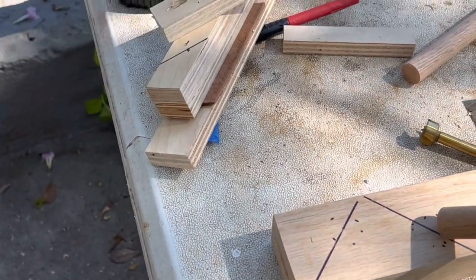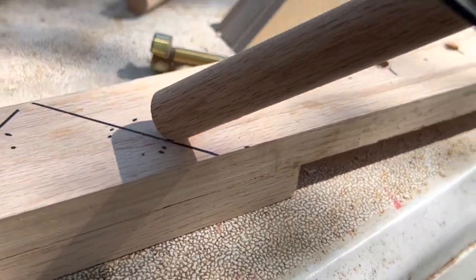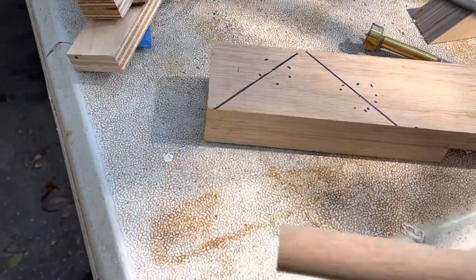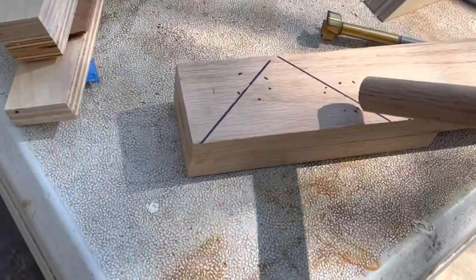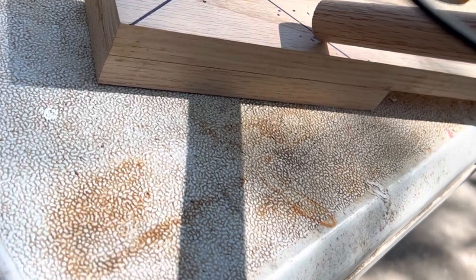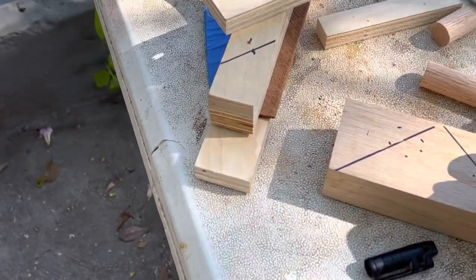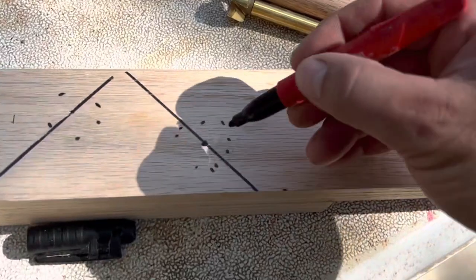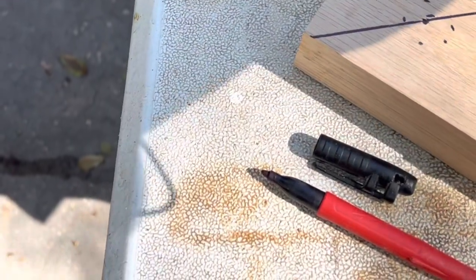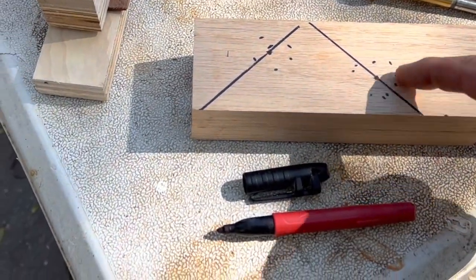And when I place the handle like this, if you can see the edge, the bottom edge is about 1/2 inch to 3/4 of an inch away from the edge here. So if I place it like that, and I kind of sight down, if I place it roughly at 45 degrees both ways, and I sight down where the middle of the dowel is, the middle of the dowel ends up about here and about here. And those distances from the edge are about 1 inch, 1 inch. So the middle of the dowel is 1 inch in from the edges.